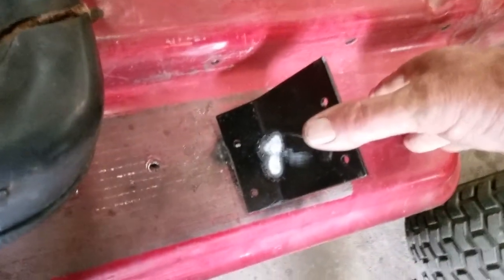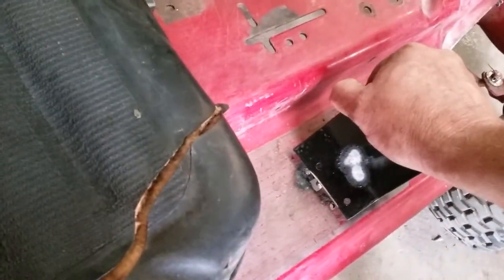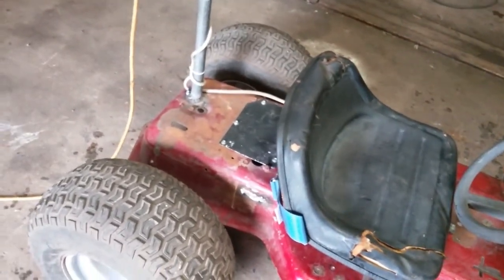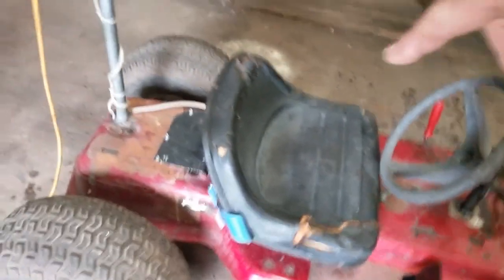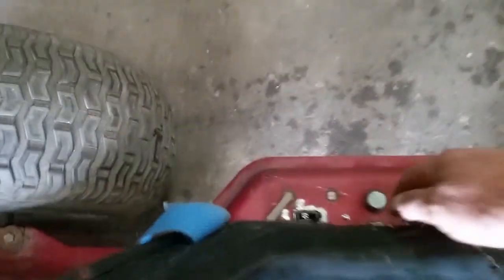It's in neutral but you can hear the transaxle kick in as I push the pedal — it's variable speed. That's the transaxle pulley spinning inside the belt, because as soon as I let off the gas pedal it takes tension off the belt. The transaxle pulley keeps spinning and until it stops it makes that grinding noise against the fan belt.